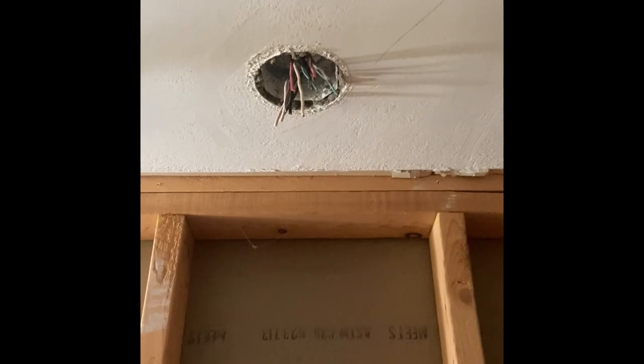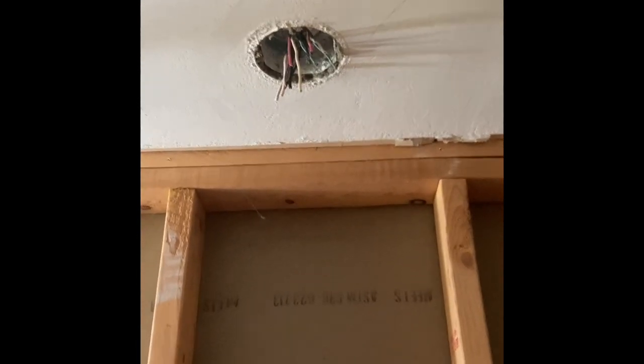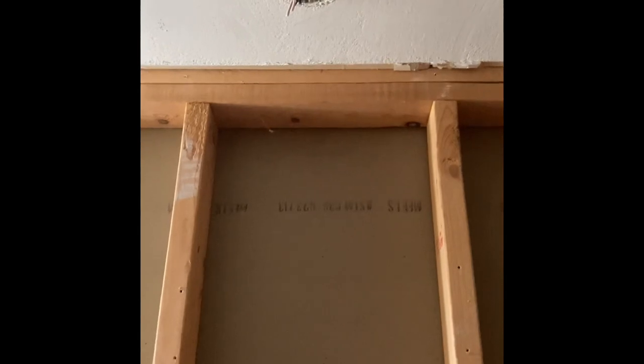We'll patch that over time, and then the new wall is going to go right in here to separate these into a half bath and the master bath. That new wall is going to go right where this electrical box is, so it's getting a little darker in here. I had to turn the power off to that and I'm going to try to get the two feeds back together — it was a three-way switch, with one switch here and another on this wall that's already shoved up in the attic — so we can have lights in the other bedrooms while we're still working on this project.